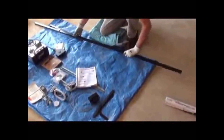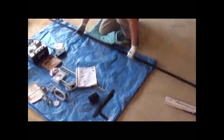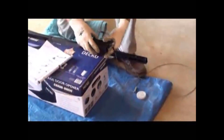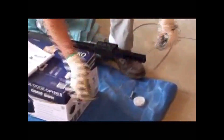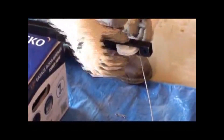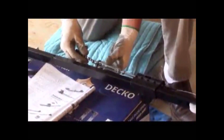The piece with the slot goes towards the front or the garage door when you put it up, and there's a little button in the back that slides into the unit head. Next step is to slide the carriage over the rail as shown here. You slip the cable through, line up the wheel, and put a pin through with a cotter pin — very simple.